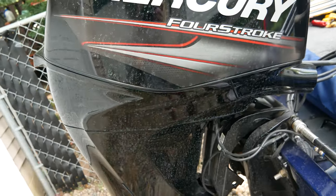The boat comes with two lockable storage containers — the first is in the rear, and the second on the left side is your rod locker, with additional plain storage. The boat does not come with an onboard battery charger. I was able to get the dealer to install one — they're not too expensive and dealers are usually happy to throw it in as part of the deal. This is a Minn Kota digital charger for two banks, routed through the back. You simply plug it in and leave the door open so heat doesn't build up.